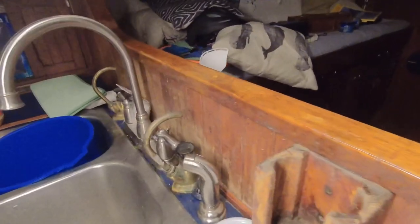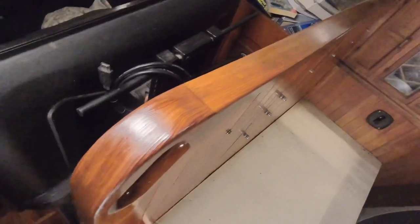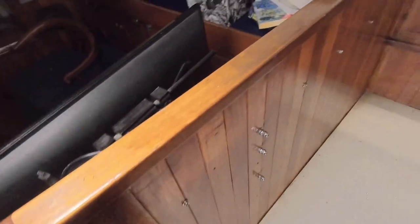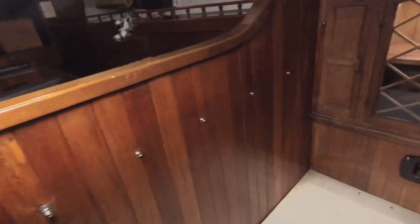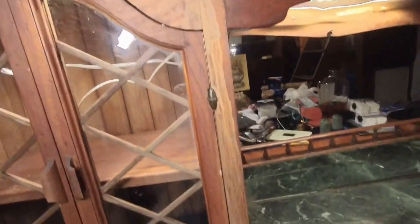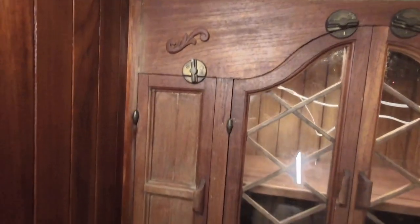You can see the kitchen — that's still going to need a lot of work. I'll probably have to sand it down to get the water stains out. After just one coat it's already looking pretty good, though there is a little bit of color variation. I'm hoping that as I apply more coats, the areas where the varnish is already decent won't soak up as much, but the drier wood will obviously soak up a lot more. I'm really hoping this water stain comes out — if it doesn't, I'm just going to have to sand it back. The wood is old and tired, and it's been a long time since it's seen much love.